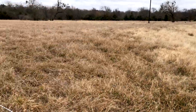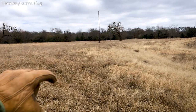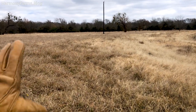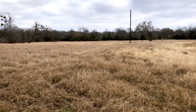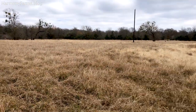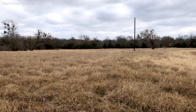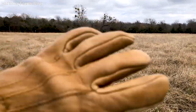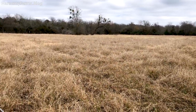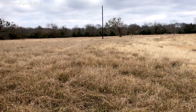Here is the field — it goes beyond, keeps going. It's a big open 10-acre pasture. Because we're grazing a semi-small amount of animals, the paddocks sometimes will be right here in the middle of the field with no access to the power. So ideally we could cross fence it, but we're just not doing that right now. I saw on the Internet somewhere that somebody had just put a ground rod right wherever they would put their charger. I thought, if I could be strategic — not just plant 67 ground rods wherever — but if I could plan: rod right here, rod right there, rod right there — I would only need six if I'm strategic, and it does the job for me.